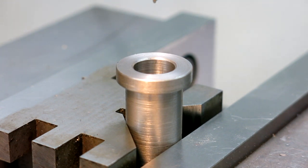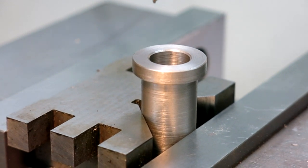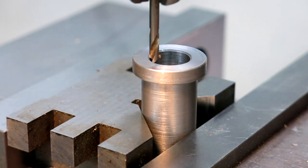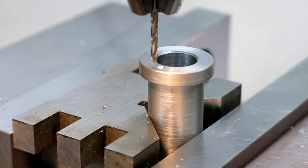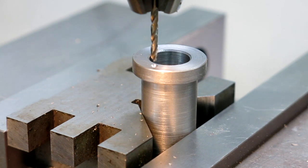All right. That looks pretty good. Let's try that. Our number's 370 off the center. And then we'll get a nice spot drill on it first. Turn them all right. All right, let's see how this works here. It's not a real big drill. I'm using a stub here, so. Actually, I'm going to come over here and zero my quill readout, and I'll come back over. All right, cross your fingers, boys. See what happens here.